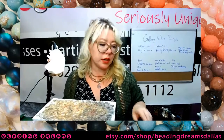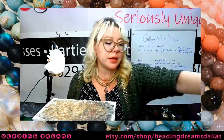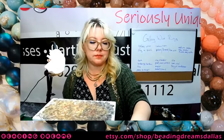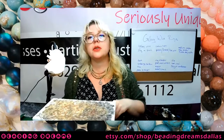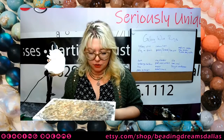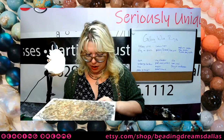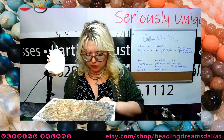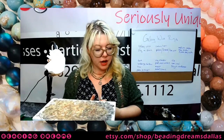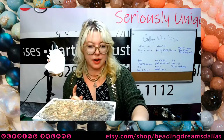So you can continue working on it. Because like I said earlier, sterling silver is a very princessy metal. And so a lot of times when you are soldering, you'll get to the point where your solder literally will not flow because your metal is so dirty. So at that point, what you do is you pickle your metal so that all that crap gets cleaned off of it, and then you can continue to solder on it.